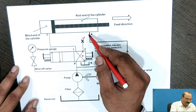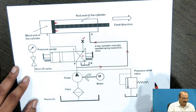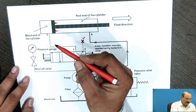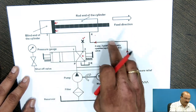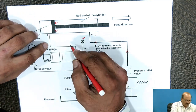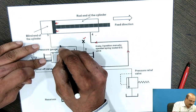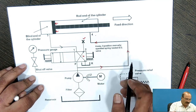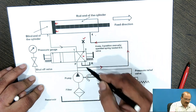When oil is flowing through this way, it is going to be acting with force on the rod end side of the piston. So here this is acting on the rod end side, then it is going to be forcing in this direction. This is the inlet and this is becoming the outlet. The oil coming through this way comes back to the reservoir. During this process, high pressure oil is flowing this way and lower pressure oil is coming through this way, and that will come to the reservoir.